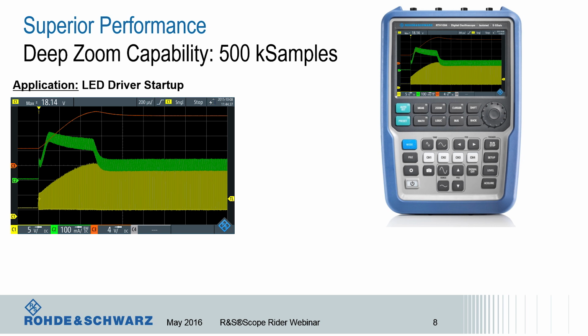Zoom is something that essentially only makes sense if you have enough memory available. When you remember the beginning of my talk, you might remember that scopes typically had only about 10 kilosamples in the handheld segment. We said, okay, 10 kilosamples is not enough for providing significant zoom capability. So we decided to give a lot of memory into the scope for this segment, so it's 500 kilosamples. And you can see from this example, a LED driver startup that we analyzed here, that it allows you to go into the details of the startup behavior.